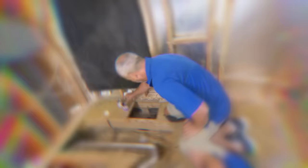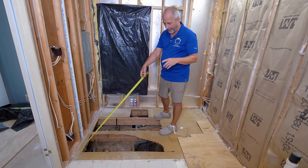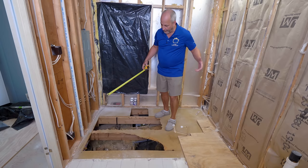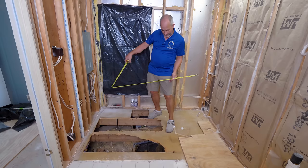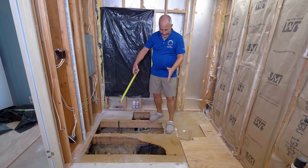We're back at the project and I've finally sorted my plan. I'm adding subfloor throughout the rest of the house; the existing vinyl floor in this room is about a half inch lower than the finished flooring. I'm going to add three-quarter inch plywood over all of this existing material, then come in from underneath to clean out the old structure, insulate, and close it back up at a later stage. For now, the focus is getting this closed so I've got the soaker tub — it's a monster with a center drain, which is why we moved the pipe to roughly the center of the room. I'm going to put in a piece of plywood, cut the plumbing supply lines clean off, and then bring the tub in.